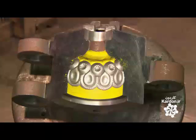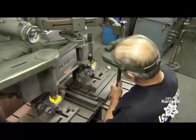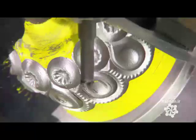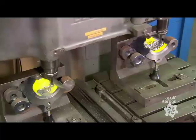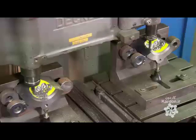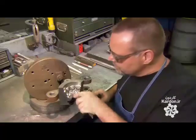Once he finishes the pattern, he mounts the mold section on one side of a mechanical copying machine called a pantograph. On the other side, he mounts another section of the mold which doesn't yet have the carved pattern. The pantograph's stylus traces the pattern on the carved section and simultaneously moves an engraving tool through the identical motions on the uncarved section, transferring the pattern. Because this is a three-sectioned mold, they make two copies on the pantograph. The carving tools leave marks on the surface of the cavity, so the next step is to polish them away with emery paper.